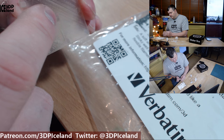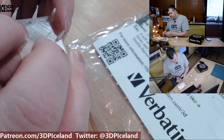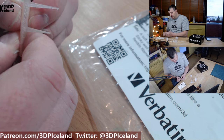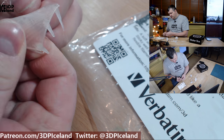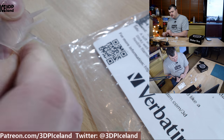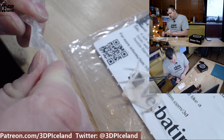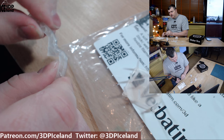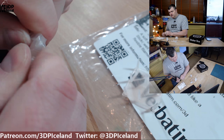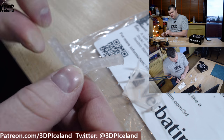There's a little bit of residue from previous filament on the back side from cleaning out the nozzle, but other than that it came out great. You can bend this in any direction and it won't delaminate the layers — layer adhesion is excellent. I printed out test pieces and they're unable to be broken; they just bend. You can twist them quite a bit and they won't break, though they do deform after twisting.